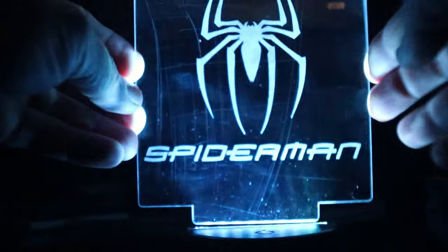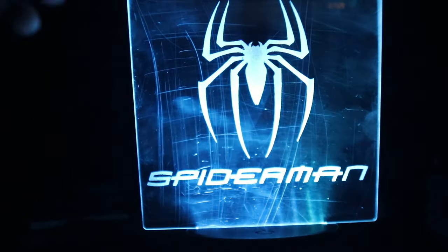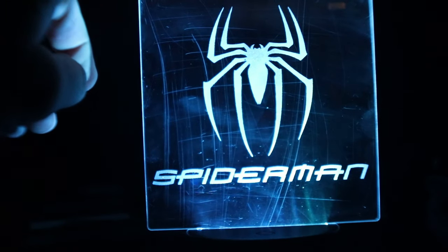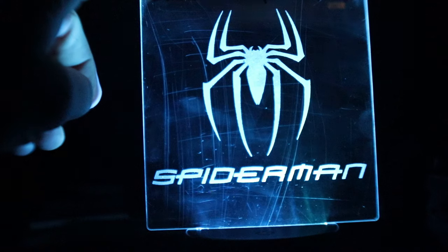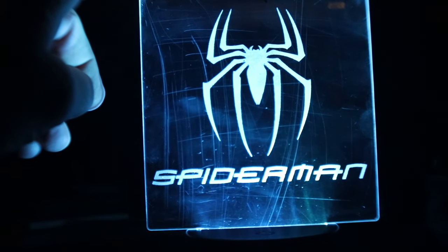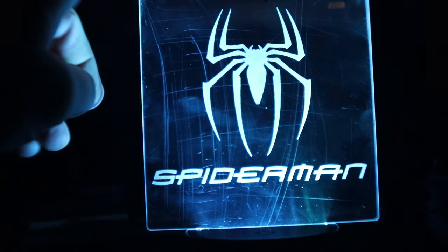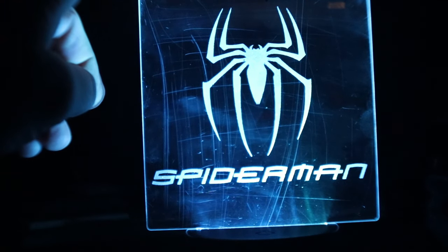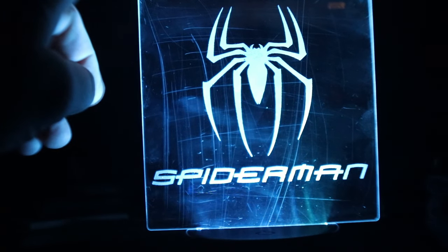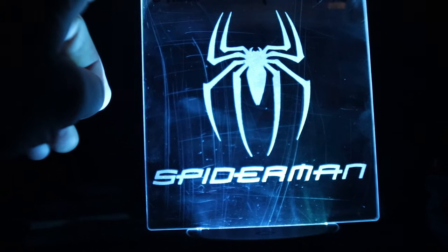And then our third is our Enduramark. So the Enduramark was 40% power at 40 millimeters a second. And the Enduramark is clearly much cleaner. I don't know if you can see the difference on the camera or not, but I actually will do some pictures of each one out of the base so you can see the difference of how they look when they're not being lit up. But Enduramark is clearly the winner.